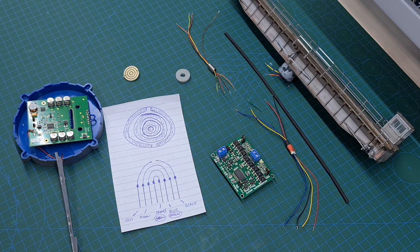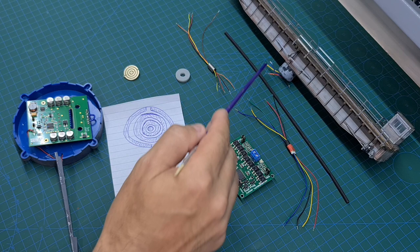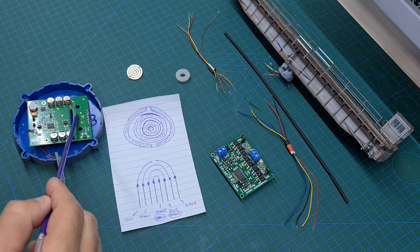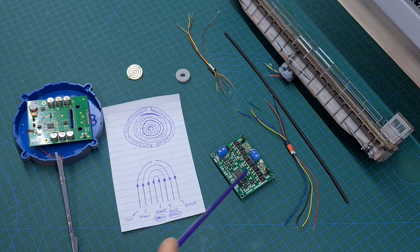To change from a mechanical solution to a digital one, there are a few things I'm going to be doing. I've already removed the PCB from underneath. There's no longer going to be a physical disconnect with the rails at that gap - instead there's going to be a set of wires that go from the bridge straight to the control board underneath. Externally, the two rails will be controlled by this dual frog juicer here.